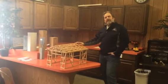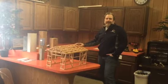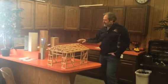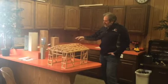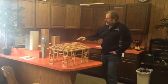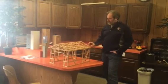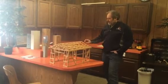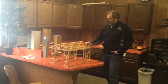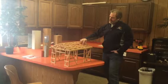The question is why four foot on center for trusses compared to eight, nine, or ten foot. We have a building here and these trusses are four foot on center — it's a scale model. What it is, is we put our two by fours flat every two feet, and that gives you a three and a half inch wide board to nail down onto the truss, with only four feet between trusses.